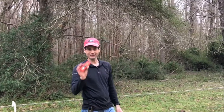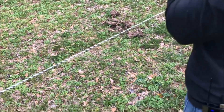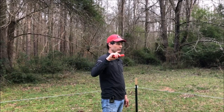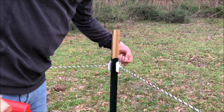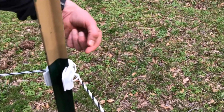All right, so now we're at the far end. I wanted to show what our last turn was and then how we connected it. I brought the charger down here — this is at least 1,800 feet into it, and it still reads green at 8,000 volts again. So that's awesome. I'm really excited about that. I think this charger is supposed to reach at least two miles, maybe three miles. We're going to have like two-fifths of a mile or less than that, so we've got plenty more we could do if we ended up doing another one with sheep or extending it different directions with this same charger. We have a T-post in here with an insulator, so we're running it around the outside. There's a plastic piece — a little pin that goes there and keeps it in place. It's not touching any of the metal — if it touched the T-post, it would short out.